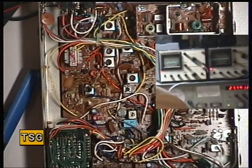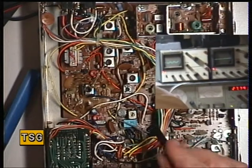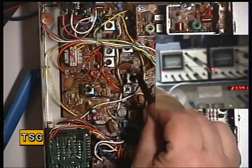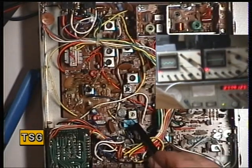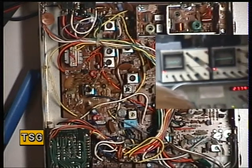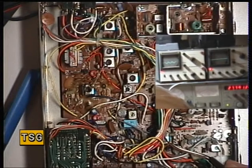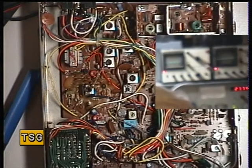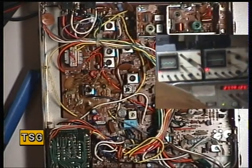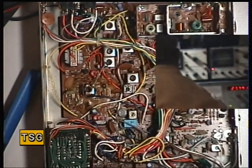That is maximum, so that's the receiver — that coil, that coil, that coil, that coil. And that's the detector, which is often overlooked — that one is for maximum audio output with a big signal. That concludes the basic receiver alignment, and we just need to do a sensitivity check.